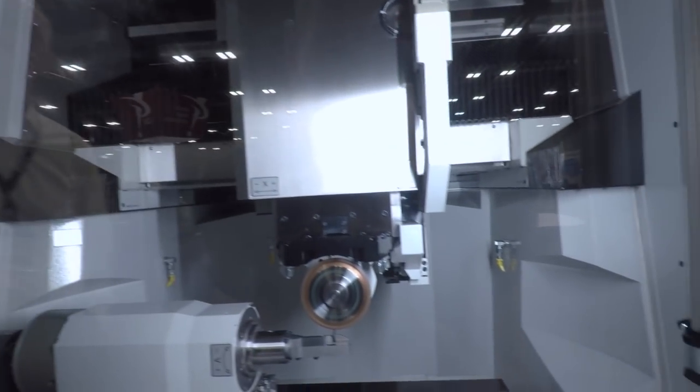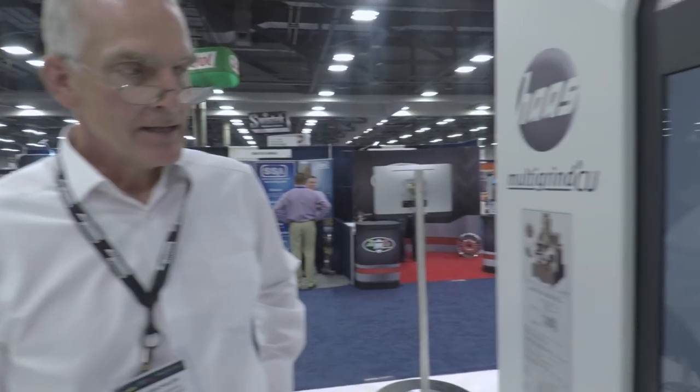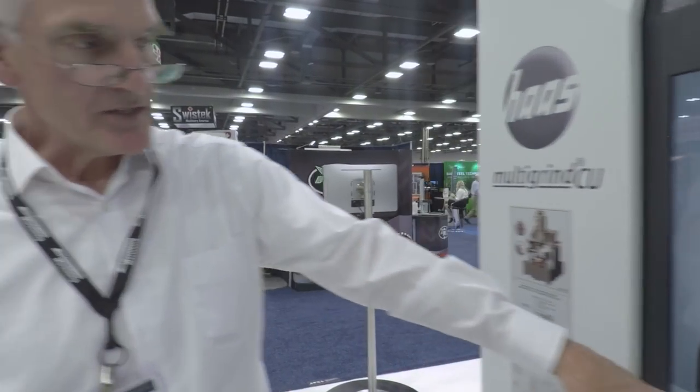It is beautiful — five-axis simultaneous grinding. You're grinding an insert? Correct, solid carbide. Very cool. With a diamond wheel? We are — metal bond diamond wheel. What's the other axis or wheel here for? That's a dressing spindle — to maintain the profile on the grinding wheel. Got it. Very cool.